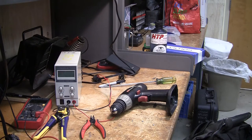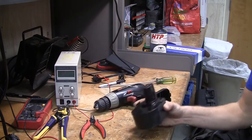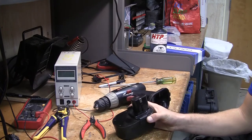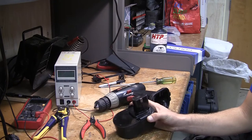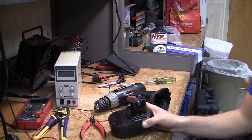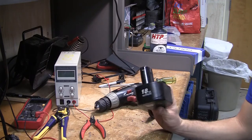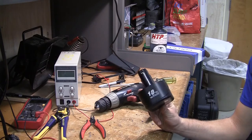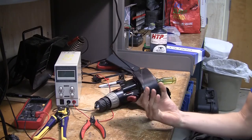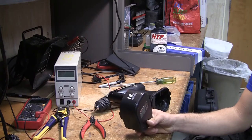I'm also taking note of the battery that came with this cordless drill. Because it's battery powered, you know it'll be a DC circuit — there is no such thing as an AC battery. So off the bat I already know it's a DC circuit, and because this battery is 18 volts, it's safe to assume that this circuit is going to be powered by about 18 volts.